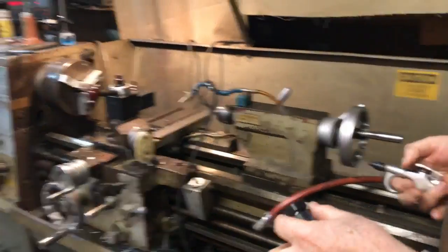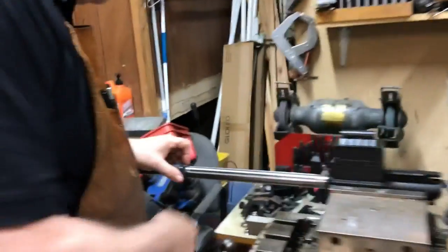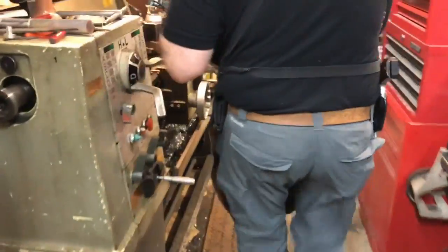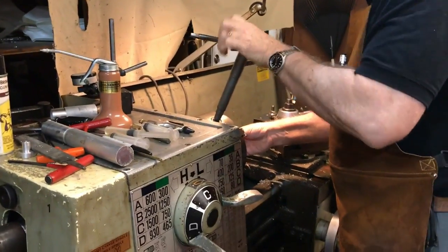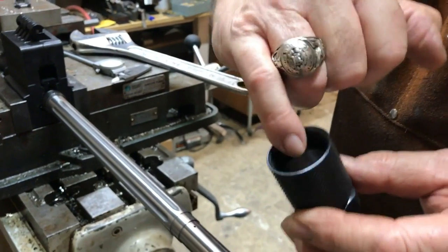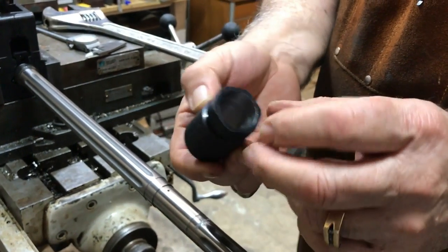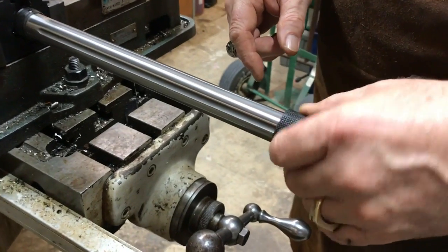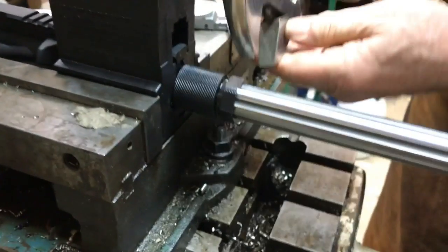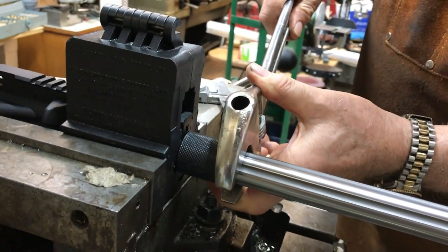It's all done — we're gonna try it. That looks pretty spiffy; the barrel's right over here. He finished honing out that little piece and I wanted to show you where it goes. This is the threaded piece that has a shoulder on it — we hollowed out the front end of it. This barrel nut slides over the length of the barrel — that's where it was sticking, wouldn't go over. He tightened it in there; the barrel's got that little pin and then he torques it down about 40 foot-pounds.